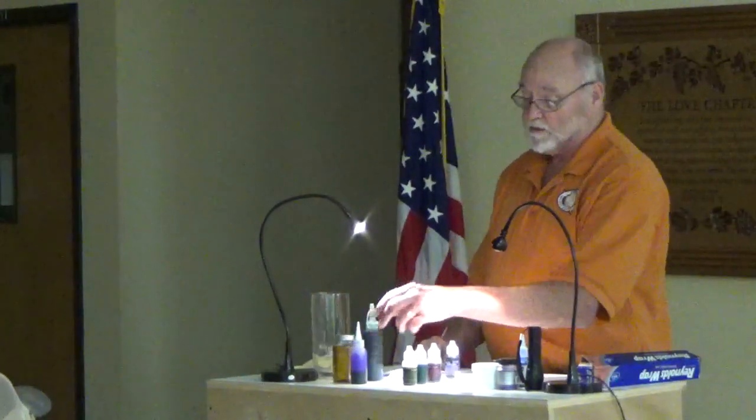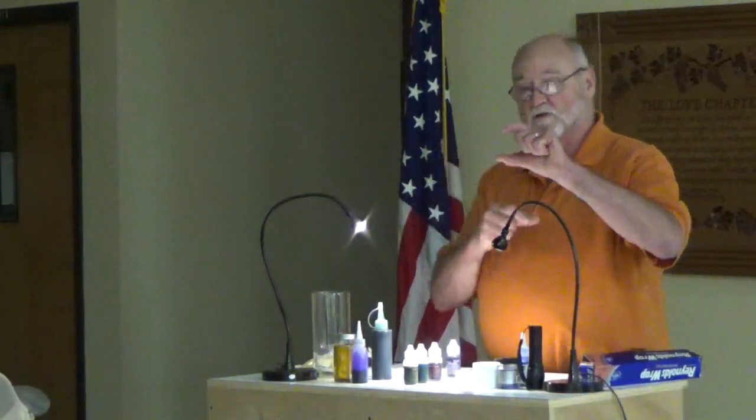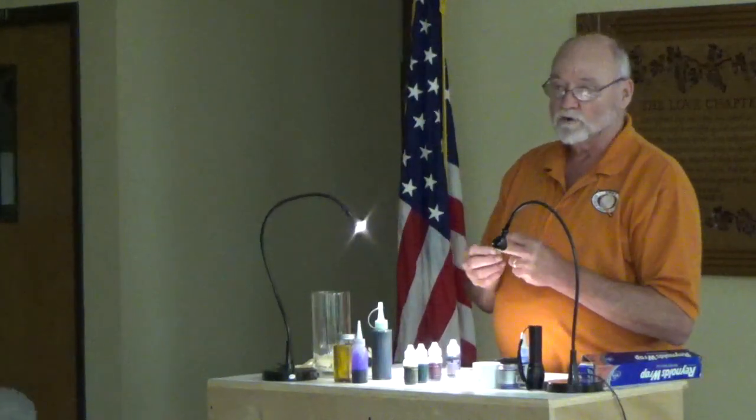Okay. If you're going to do a two-color block of wood, take the one color, let's say you take the blue, let it just sit in a tray. Get your little plastic tray, about this deep, weight your blank down, submerge your blank, and you'll see bubbles start to come out. Again, dry blank, by capillary action, it will start to fill the blank. It'll start filling the wood. Okay? Now, if you want to do two colors, take that blank at that time.